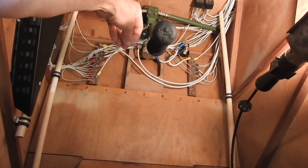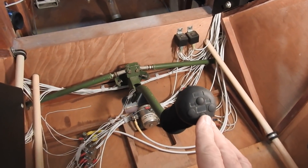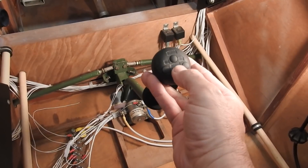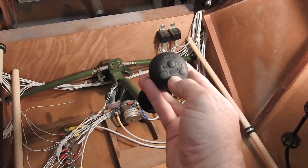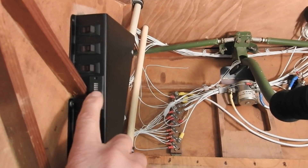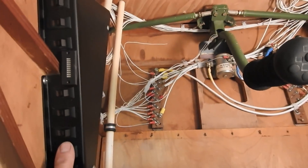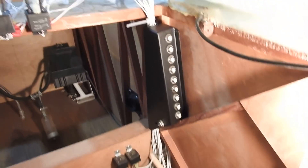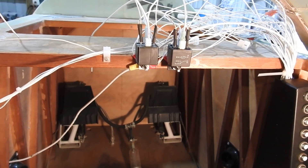This little wire is a dimming wire for this little elevator trim. The elevator trim is the buttons here — you have up and down elevator, and then left and right is for the flaps, down and up, nose down and nose up with the trim. You'll see the indication in here — there's a green LED right in the center when it's neutral, and then up and down trim. You can see I've got all the switches back in and all the circuit breakers back in.